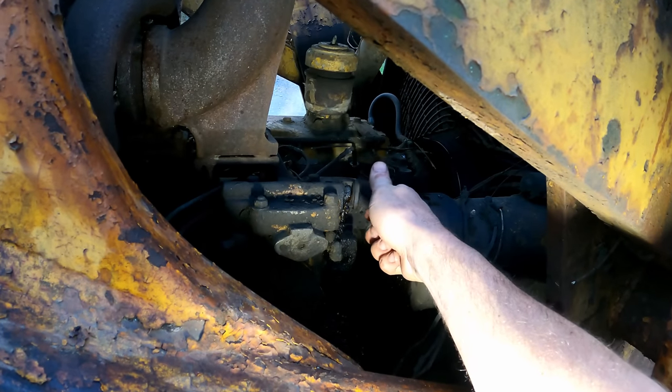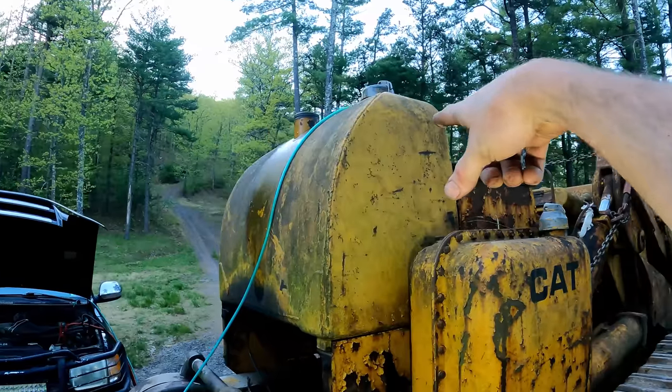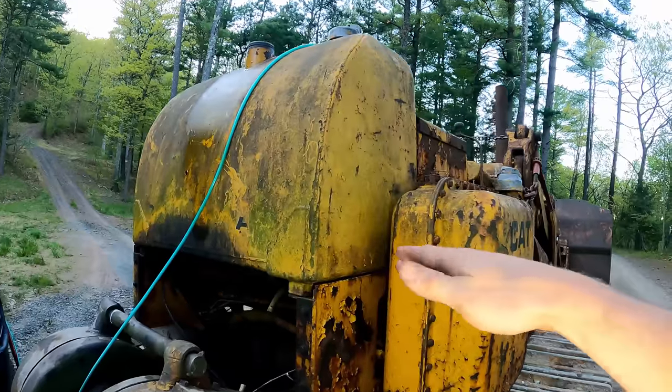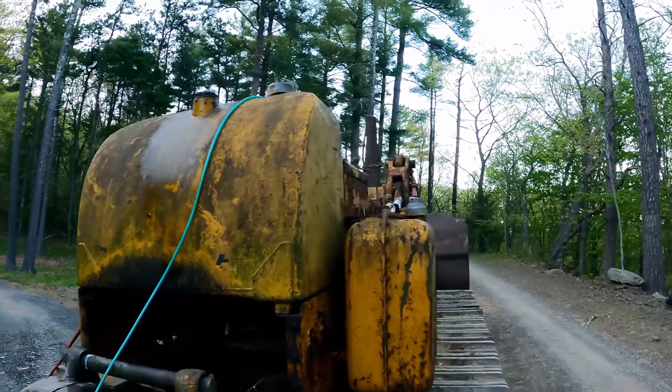If you don't know how to manually prime the system, then you improvise. I just had fuel shooting out of there. What we did is just pressurize the tank a little bit, push that through. I did end up putting another 5 gallons in here too, but just didn't have enough head to prime it. Okay.